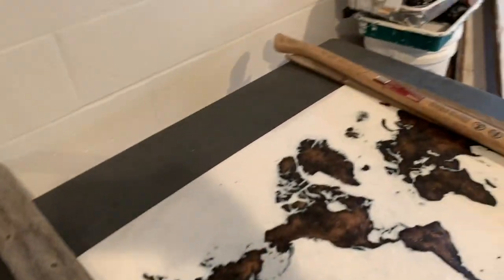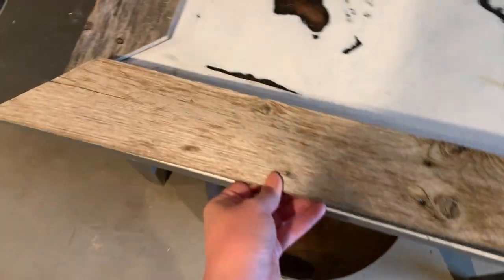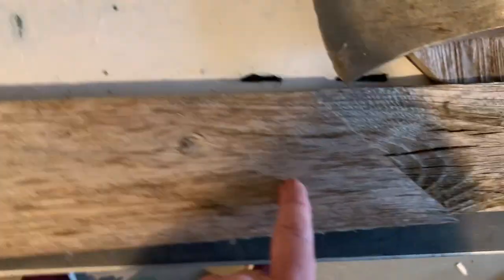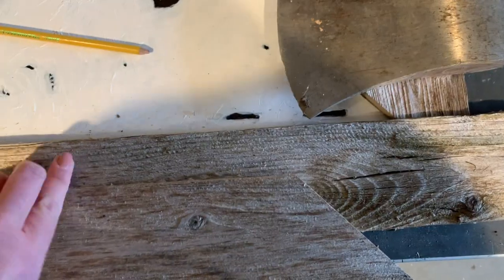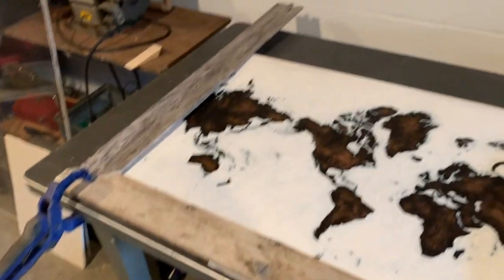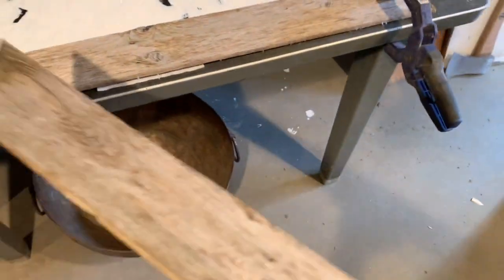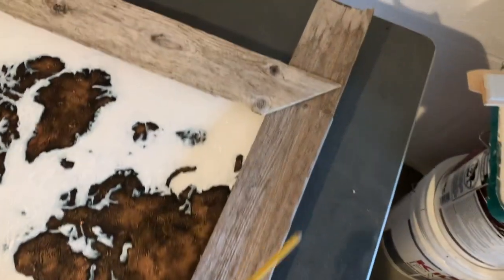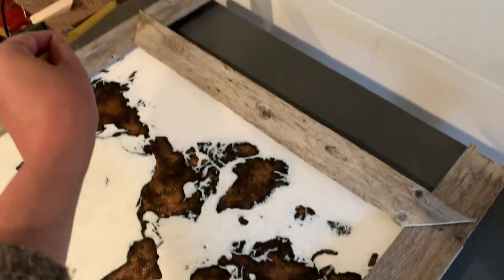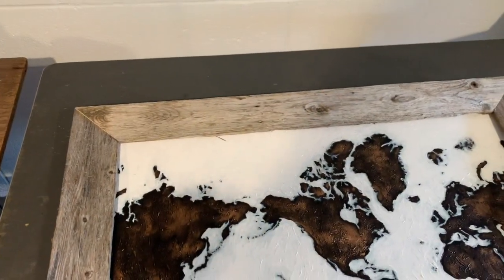Put it up there and then we can mark how long we want those ends to be. This is the bottom piece — I already cut 45 degrees on this side, so you can either line it up perfectly and mark right here, or you can take your tape measure and measure this top edge and then transfer that measurement to your bottom piece — that will be where you need to make your cut. That's three sides done. This is the top piece that we made from copying the bottom piece, so we're gonna place that top piece where we want the frame to stop and mark, and we should have a square frame.